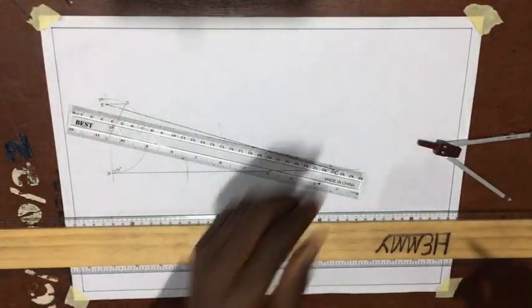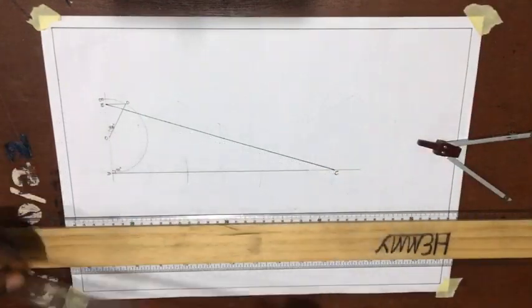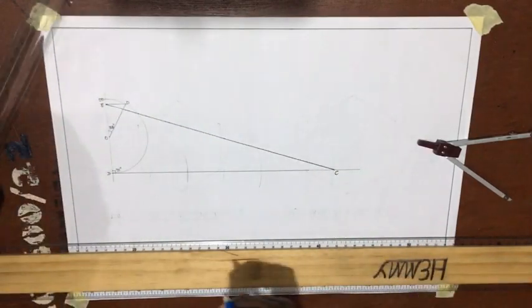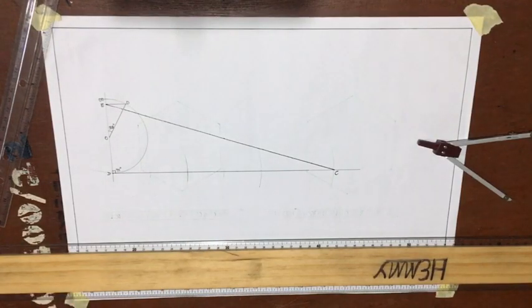So the measurement of our line CE being taken, we have the desired or the required circumference of our circle. So for us to check out if we are right, we then make use of our formula to calculate for the circumference of a circle, which is 2πR. So in this instance, we make use of our 22 over 7 as the pi, and for us to get our radius, we divide our diameter into 2 equal halves, which is 38 millimeter, since our diameter is given to be 76 millimeter.